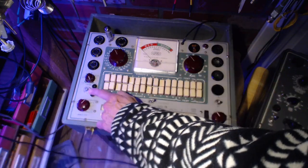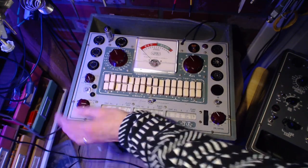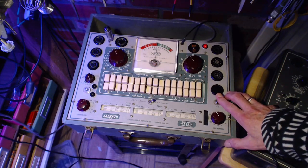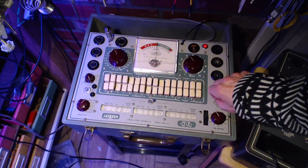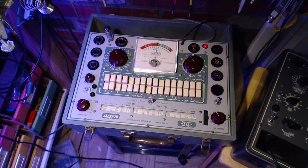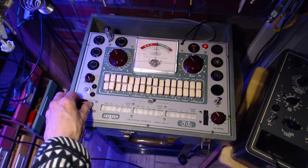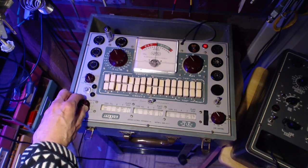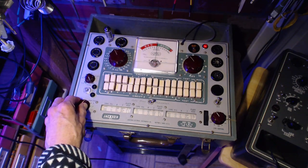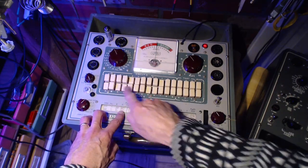Now, shorts. Watching the light on this one. I don't think it's warmed up yet. I don't think I've turned this on. I have not turned it on. You'd think by now I would have learned enough to turn things on. But no. Okay, shorts now. Watching the light. Typically, this light should flash a bit from charges on the tube elements. Did I get this right? 6AQ5, 237, AC156.